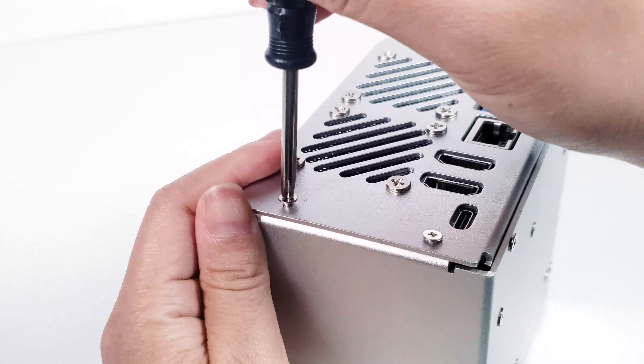Take the Acrylic Plate E and remove the protective paper. Secure Acrylic Plate E on the IO Expander with 2 R3090 rivets. Flip the IO Expander and lift the brown tab. Insert the OLED FPC with the black tab up and press to secure.